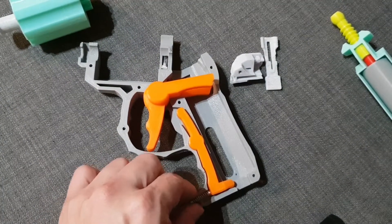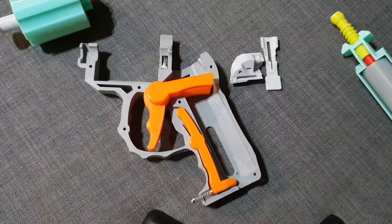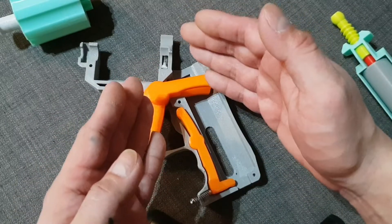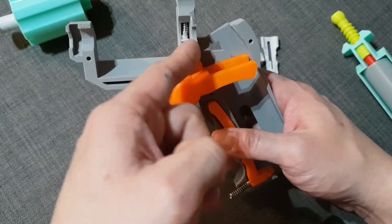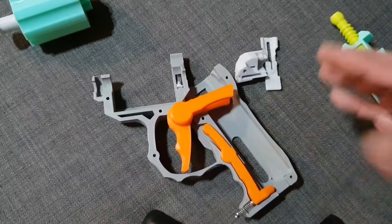Except if you want to make this one weaker, you can cut the coils after you put everything together and try if everything works okay. If you do have a problem — the trigger reset doesn't go back in place — chances are either it got stuck here, or the spring here is too strong.